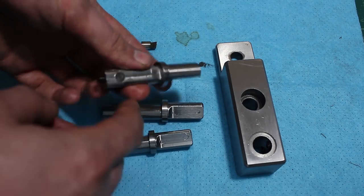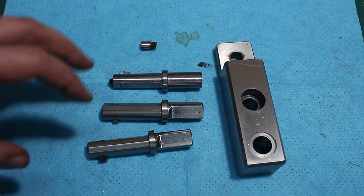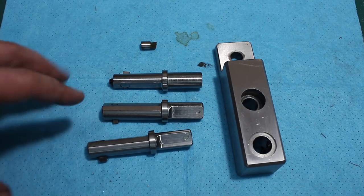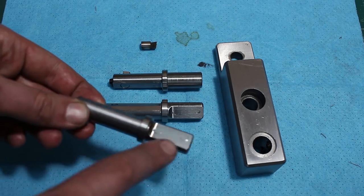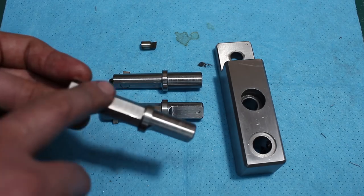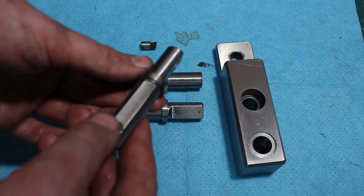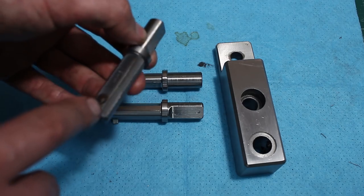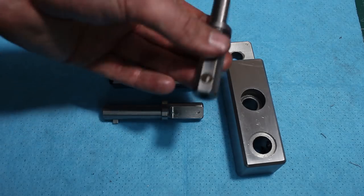They're relieved on the back, and I do that so I can get a little bit higher up in the bore. When you do slotting in small bores, space is always a problem — you get clearance issues all the time. The surface here on the side is milled in the same setup as the clearance surface on the top, so I can use this to indicate the bar flat or perpendicular, because this is milled in one setup with the drill and ream for the tool.